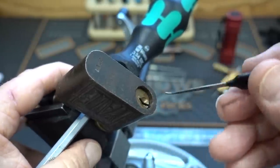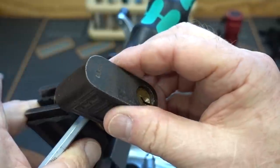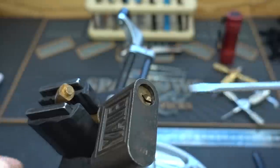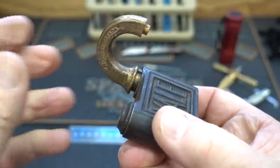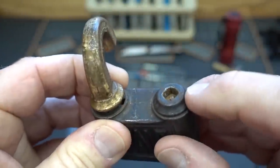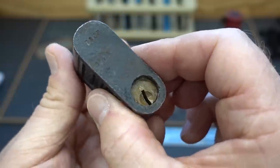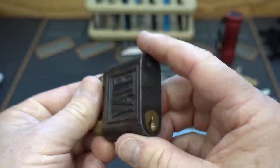And there we go. Notice how it sinks down there — it didn't go quite as deep as I thought, but notice how the whole body is now starting to turn. The keyway stays vertical, and that's because it's part of that shackle. I pull the screwdriver out — it just pops up enough. That little piece right there is interlocked in the body, and that is how this lock stays secured. And when you flip it back, notice how we rotate everything and now it pops back in place — it's again locked up. Very cool.